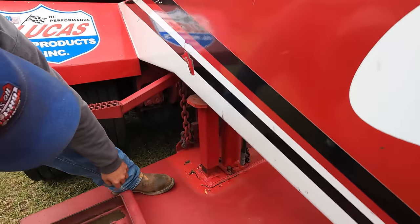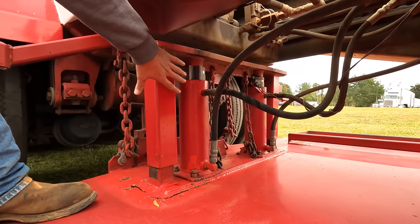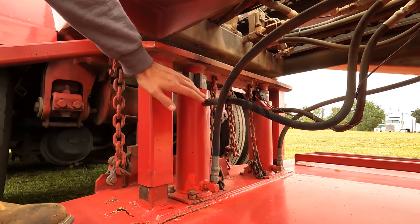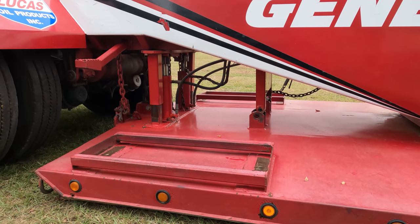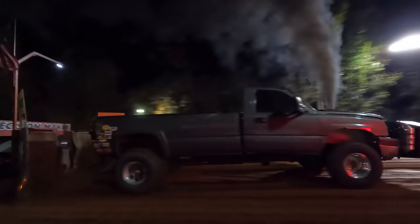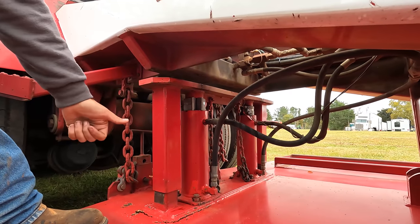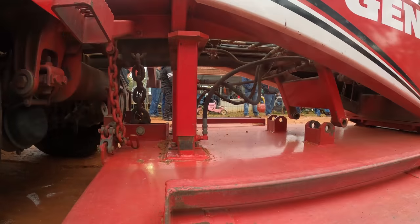Under here, these cylinders are our push-down system. They're pressurized from a hydraulic accumulator up front in between the rails. When the box hits the micro switches, these cylinders push up on the bottom of the rails and will actually lift the back of the sled off the ground. You'll see a stop with all the tires hanging in the air spinning because these cylinders have pushed a lot of force on the bottom of the rails to pick the sled up.